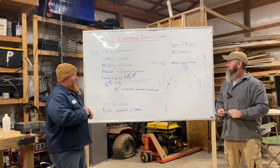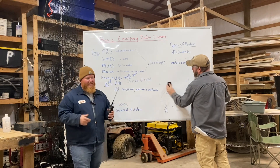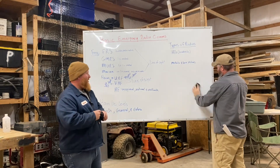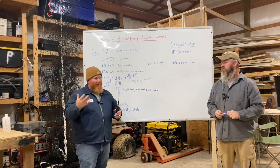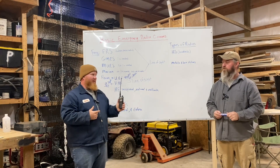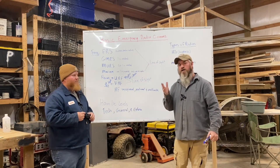There are a lot of guys who think that if they have a Baofeng and there's some kind of national emergency they can just communicate without a license. But like the saying goes — you wouldn't buy a gun if you didn't train with it. Same with a radio. If you're not training with your radio, you could be in trouble because a Baofeng doesn't provide much elevation, not enough power to push through trees, and trees are a big obstacle for a ham radio signal.